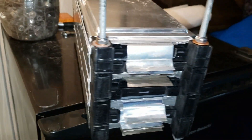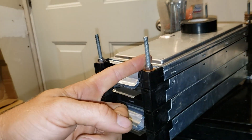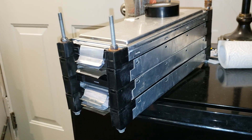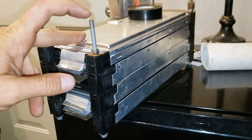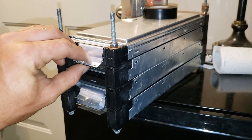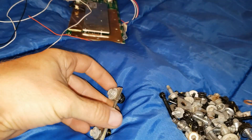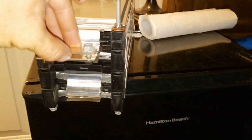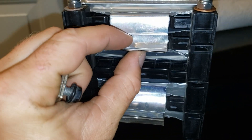We've got the LG 120 amp hour cells here. This is a 4S build I'm building for a friend. I got these bolts from that BMW battery I just took apart — they work perfect for this. You get lots of extra goodies when you take those electric car batteries apart, like the BMW with 32 kilowatt. Right here I'm going to be using these two bus bars, sandwiching the tabs together with two bolts and these two bus bars. This is all copper, all sandwiched together.